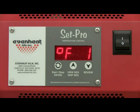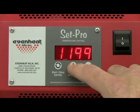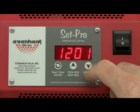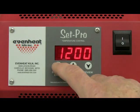The display now reads degrees Fahrenheit 1, which is asking for the desired temperature to be reached in our example program. For this example, we'll use 1200 degrees Fahrenheit. Use the up and down arrow keys to make the display read 1200. Press the enter key to store your choice.